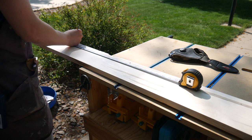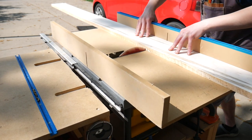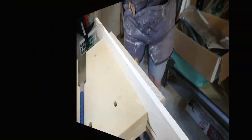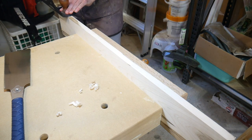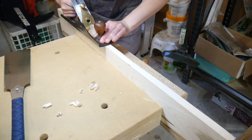I was initially drawn to this wood because of the long streaks that you get of what is actually the Ambrosia fungus going in the tree, and I thought they'd be really cool to try and do a continuous grain box of some sort. So what I did is, because you need bookmatched boards to do completely continuous grain, I found two starting and endpoint of the board that are similar as far as the grain pattern — that way the fourth corner which doesn't perfectly line up would at least look somewhat continuous.